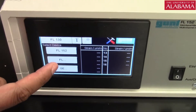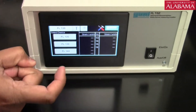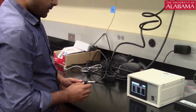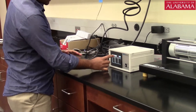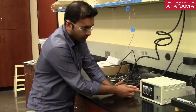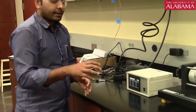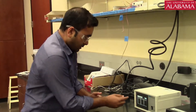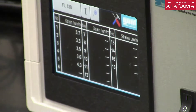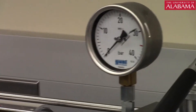We have different other connection types such as FL-152, but our goal is to stay on FL-130. Right now we are at zero pressure and should have zero strain. The five channels shown correspond to strain gauges at five angles. Channel one gives strain data from the zero degree gauge. Right now channel one is showing 3.2 micro-strain coming from the zero degree gauge connected with the red wire.